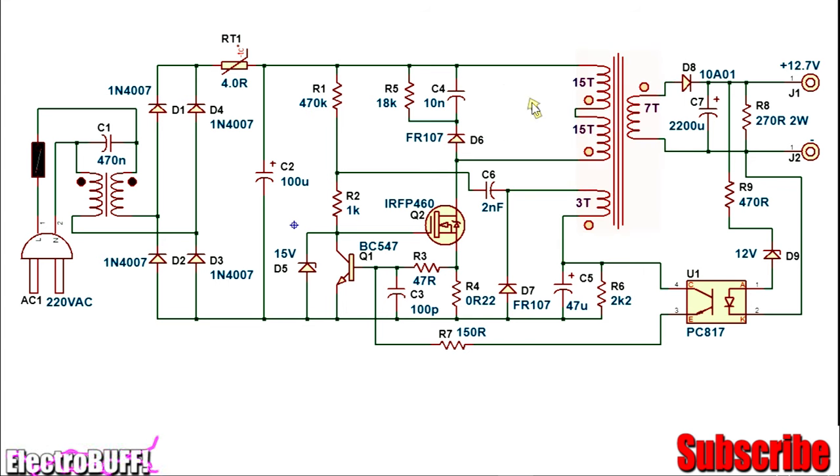The transformer windings are as shown: the primary is 30 turns, the secondary is 7 turns, and the auxiliary is 3 turns. When winding the primary, you first wind the initial 15 turns, then add about 5 layers of insulation, make the secondary winding of 7 turns, then add 5 layers of insulation, then make the auxiliary winding of 3 turns with about 3 layers of insulation, then make the remaining 15 turns of the primary winding. This way, the entire secondary and auxiliary turns are sandwiched between the primary winding, which maximizes efficiency by optimizing coupling between the primary and the secondary and auxiliary windings.